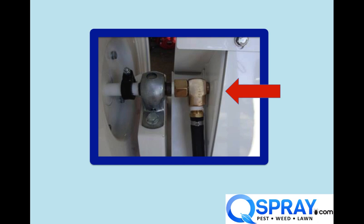Here's a different situation, but one that we found quite amusing. This was a sprayer one of our competitors built, and the frame is so tight around the hose reel swivel that it's impossible to repair this swivel without pulling the entire sprayer out of the truck and removing the hose reel. So what should be a five-minute job becomes a two- or three- or four-hour job because you can't get to this hose reel to repair the swivel. Just a really bad idea.